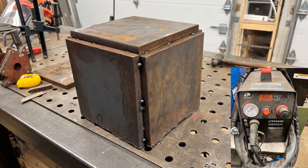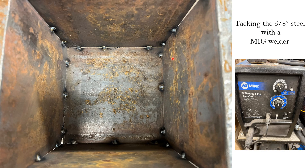Maybe it wasn't my skill, or I didn't have enough air pressure — whatever it was, not very good. Regardless, I ended up making this cube. I'm tacking it together, just using little tacks. This is my Millermatic 140, a 120-volt MIG welder. I'll crank it all the way up, just enough to get tacks. I can then use my hammer, pound these into place, and try to get things as square as possible despite those imperfections.